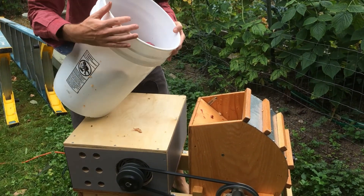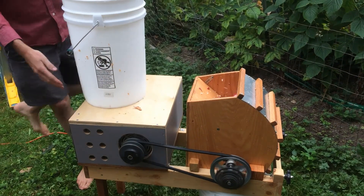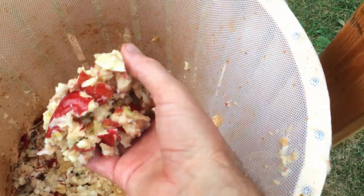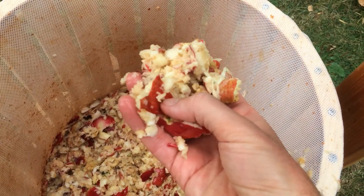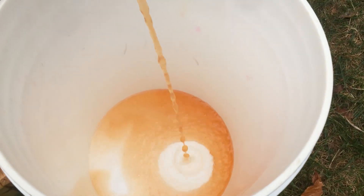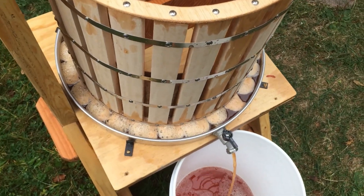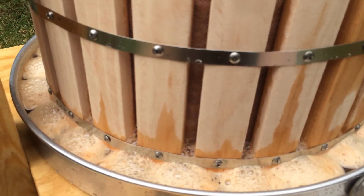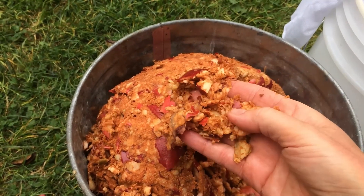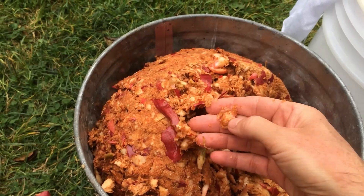So let's see it work. As you can see here, the grinder is kind of a beast — it chews through these apples without any trouble. This is at 50% of the max speed of the grinder; it's even more terrifying at full speed. It doesn't spit back too much, unless you only add one apple at a time, in which case it can throw some apple chunks in your face. What you see here is actually an earlier grind — I think this is way too chunky, but this is before I lowered the teeth height and learned how to grind with a higher RPM. It's better now, but still not perfect. Because the frame isn't quite as strong as I wish it was, I can't really work the jack too hard. It seems like there is still a fair amount of juice in this pulp, but overall pretty happy with it.